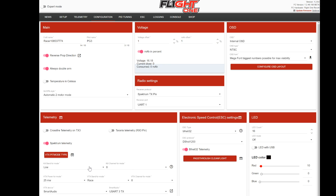Once you've done that, we have a few options. We have a kill switch — what this does is disable your radio and also changes the VTX channel to your kill channel. You can flick a switch and completely disable your quad. If you're in a team race and you crash, or if you get stuck in a tree, you can do it so you're not broadcasting on the main channel, keeping other people flying. On the kill band, you want to pick a channel to go to when you hit the switch. I always pick a low band like channel 8 because that gets it way off the range everyone's using.